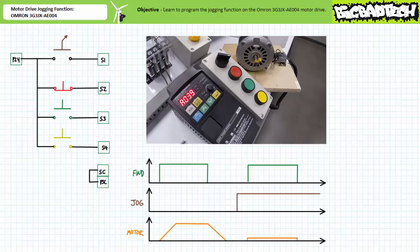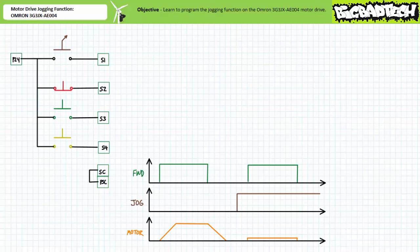The motor speed stabilizes at roughly a tenth of maximum speed, as we expect. When an operator opens input 3, the motor drive immediately halts conduction, and rather than coasting to a stop as previously, snaps to a comparatively brisk halt given the 0.5 second DC injection braking event at 50% power. Is this cool or what? Let's now adjust some of the parameters controlling the DC injection braking event.